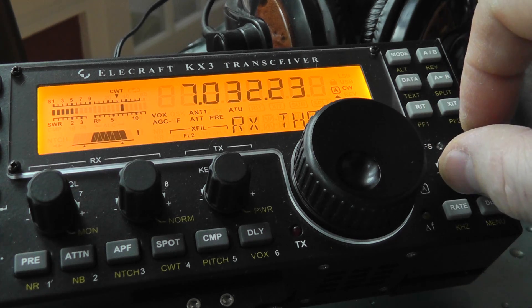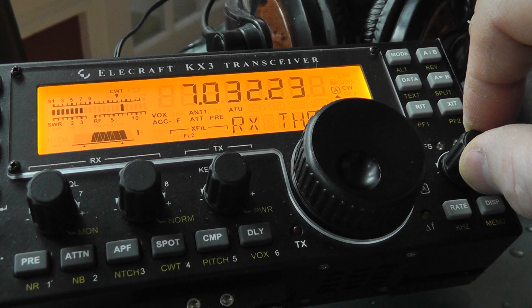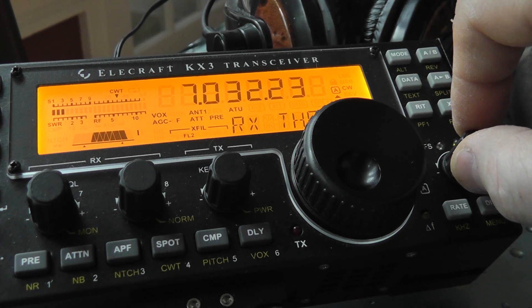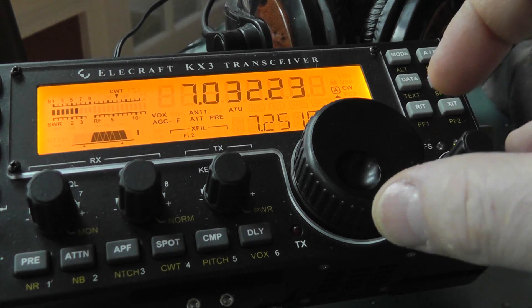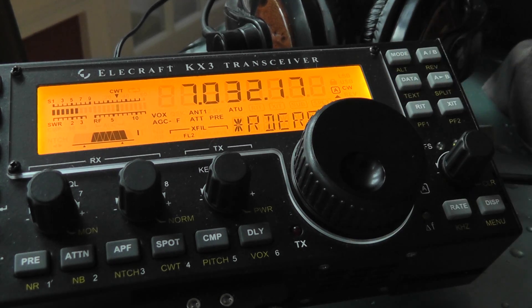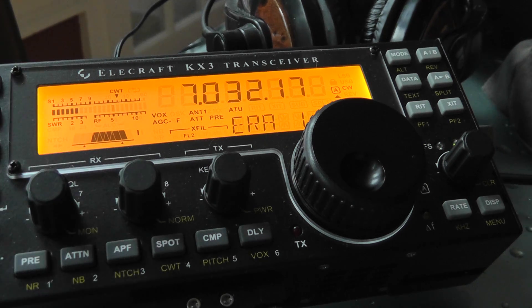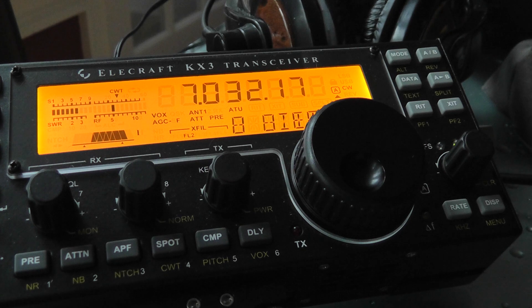Personally, I find that THR3 or 4 is the best setting for average signals. You can see it's pretty good. Now, you may have to adjust the filter some, because some of the ringing may be interpreted as letters.